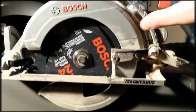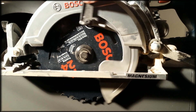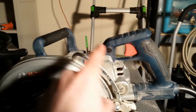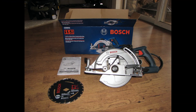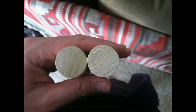From a safety standpoint, this saw hits all the possible buttons. The retractable lower guard provides nice coverage for the blade hanging down below the foot, and the dual handles — main and auxiliary — allow for a sturdy grip to help avoid unintentional kickback. It is important to note that the instructions specify that this tool is not designed for use with metal or masonry cutoff wheels; in other words, only use it on wood products.